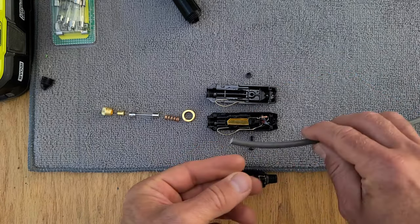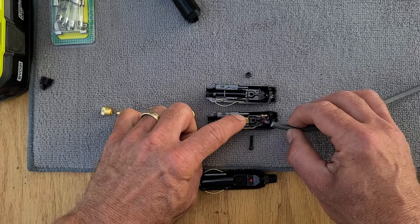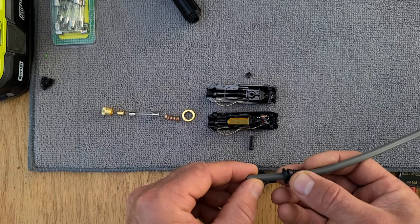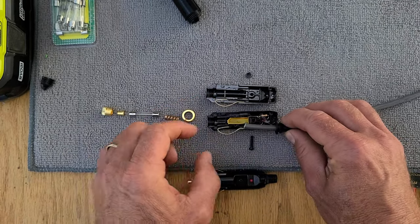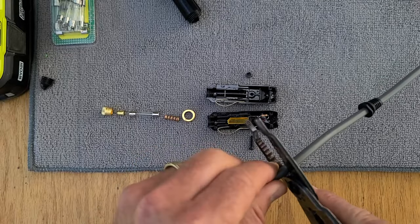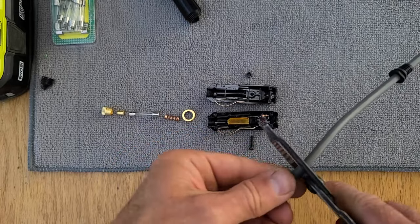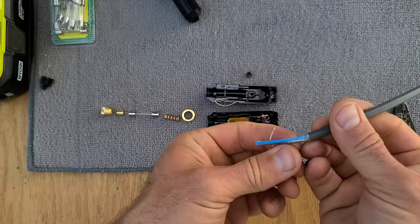So we'll put that on right now. When we go to solder here, we want to strip at least this much wire. We could possibly strip extra and then just tuck it up inside there. There is no clamp that's going to hold the wire, so we could do the same thing they did — tie a knot in it to leave a little bit extra, tie a knot right at the very back. I'm going to use this part to cut like a razor blade — you can use a razor blade too. Just don't squeeze very tight. It's a lot easier on cheaper, thinner wires to do that. If you get the good heavy-duty black wire, it's a lot better to just use the razor blade and slowly go through the jacket so you don't cut the wire on the inside.